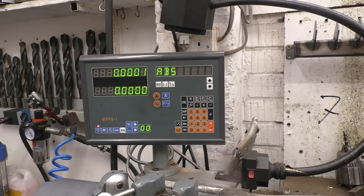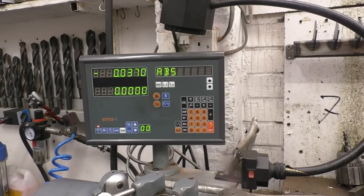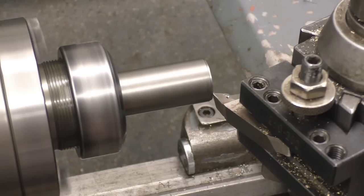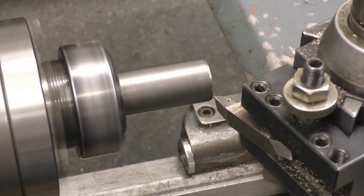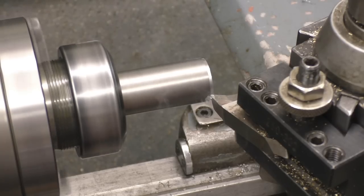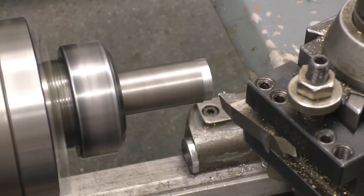This lathe is fitted with a DRO, so we can zero the DRO — that's in inches — and wind in for 200 thou, just short of the 200 thou, then do your machining to that, and then your final cut will be in to the 200. You can also zero that and machine up to zero, so when it's at zero you know you're done. Right, so I'm going to use the DRO because it's there. We'll touch it off, zero the DRO, put on some cut, and we'll work with the 200 thou — start just short of the 200 thou and do another cut.